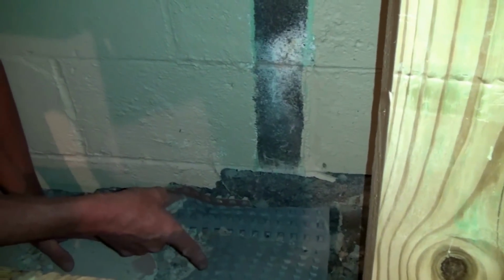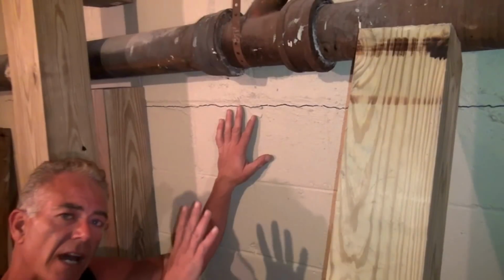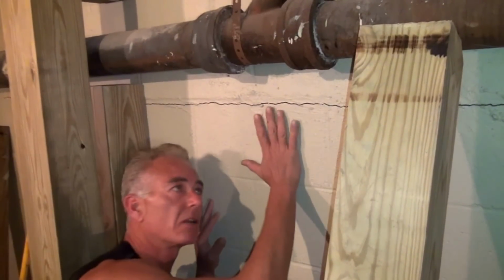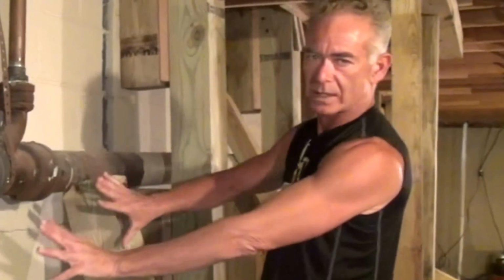And once upon a time, someone installed a half-assed pressure relief system. Had this system been installed properly, this would never happen. This is where the foundation was, and the bottom of the wall has shifted 3 inches inward. Before we dug out the foundation, this crack was much larger. Once we relieve the pressure on the outside, the wall has actually moved back all on its own. Remove that earth, and the weight of the house will cause the wall to just come back in place, because it's the weight that pushes it down and wants it to straighten out, which is what has already occurred.